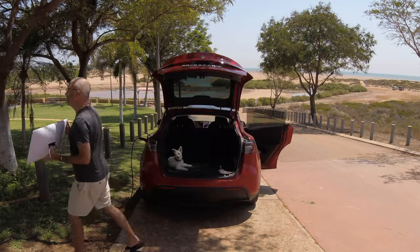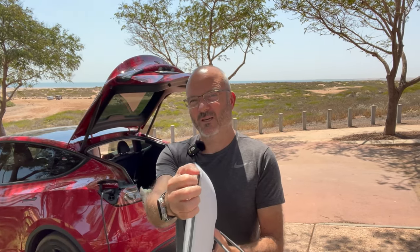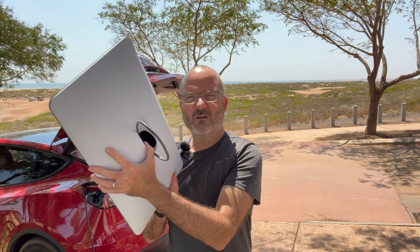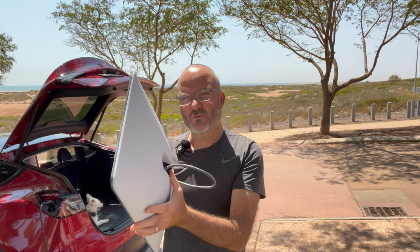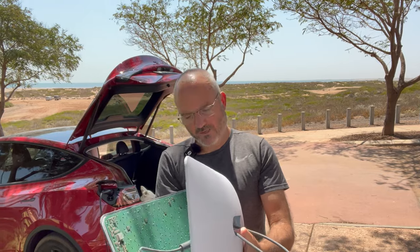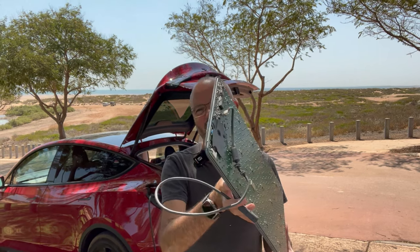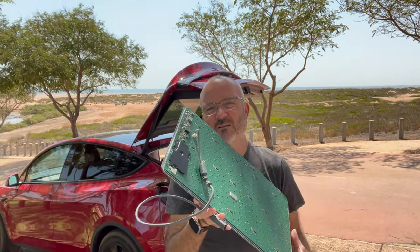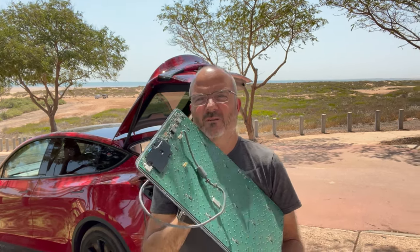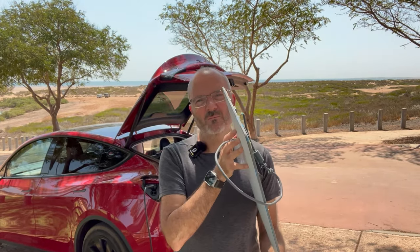For those of you that watched my previous video, you'll remember that I separated the phased array from the housing. Since then, I've also removed the metal mount. I didn't show that in my previous video, but there are plenty of other YouTubers that show how to remove that. So I've separated the phased array — all that we're left with is this very thin antenna. And this, in fact, has all of the computing that Starlink needs. Other than power coming up this cable and internet going out, there is nothing else you need. You don't actually need the Starlink router. It's a pretty slim setup.